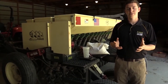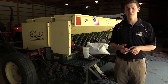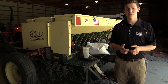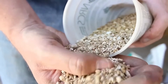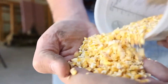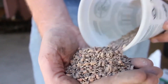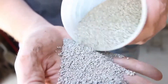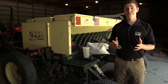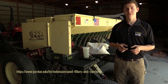Due to lower seeding rates for wildlife and more efficient seed cleaning, it may be difficult to achieve a low enough bulk seed rate on your drill. If so, you can add a filler to increase the bulk seed weight of your seed mixture. Vermiculite is a great choice when planting native warm season grasses with the fluffy seed box. Cracked corn or clay absorbent are better choices when planting native grasses using the grain box. Cat litter is a great filler when using the small seed box. Remember, adding fillers will change your seeding rate — go to the link in the video description to learn more.